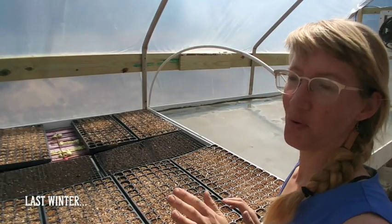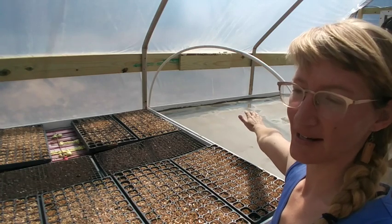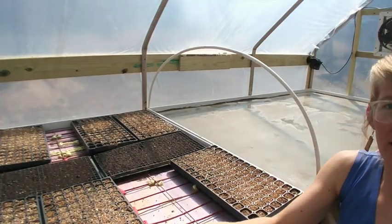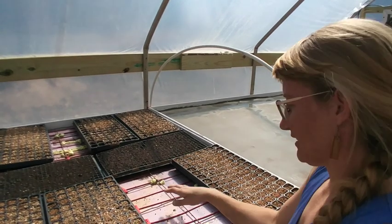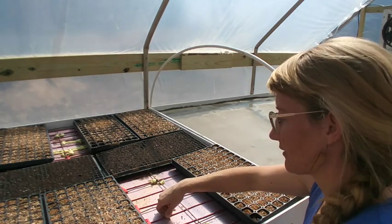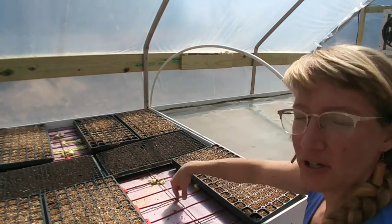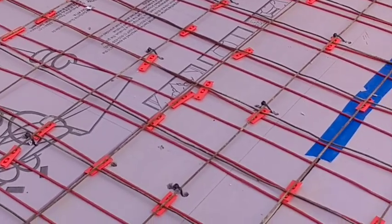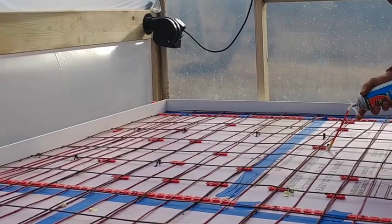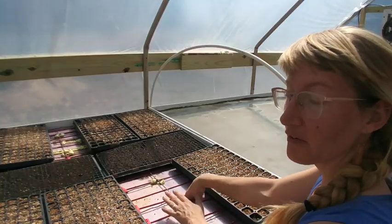I have one bench top that is already filled with mortar and concrete and that's drying. This one I have not yet put the masonry into, so you can see what's below it, which is helpful. It's this purple two-inch insulation foam, and then heating wires — the kind used for bathroom tile floor heating. Above that I put concrete reinforcing mesh, which we happened to have two pieces just the right size. I had to zip tie it down to the foam by drilling holes through and then zip tying around. That is run via electrical outlet.